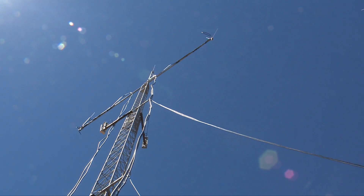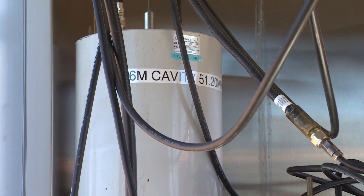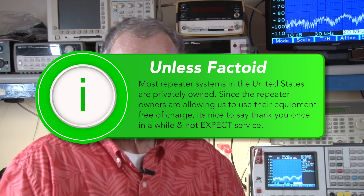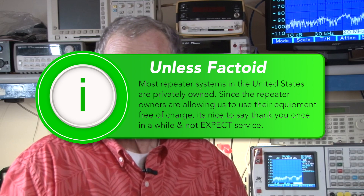We also have a six-meter repeater on 51.7 transmit and 51.2 receive, and we're going to be tying that into the other repeaters as well, so eventually if you talk on one you're talking on all of them. One reason we're doing all this is experimentation, but also to make sure everything works with RF — the internet could go down someday and in an emergency you need RF to be reliable. We're also affiliated with the Office of Emergency Services and Homeland Security in Sacramento, who use our repeater in emergencies. I'm going to be writing an article for QST shortly about the whole system.